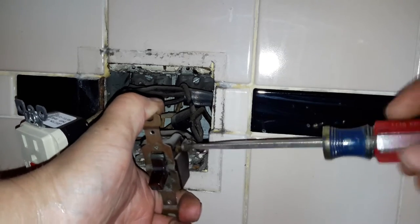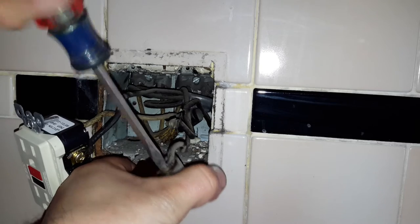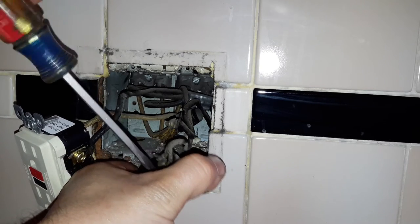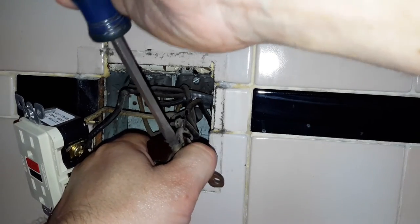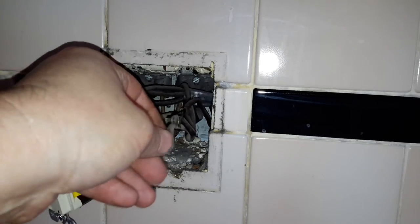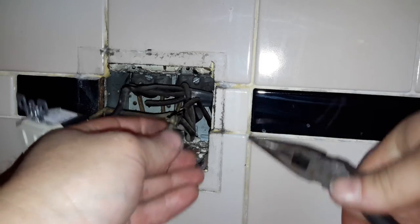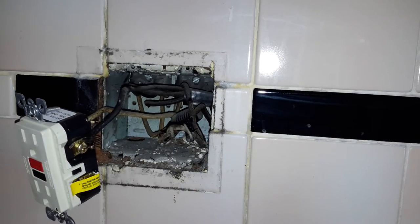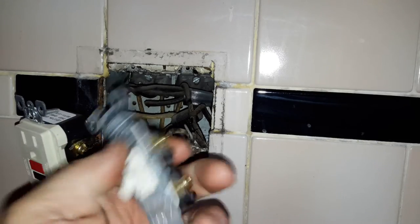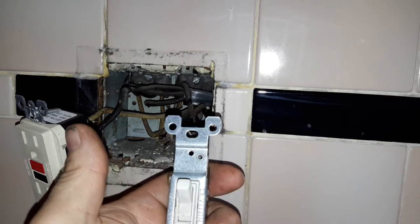On the switch, a switch cuts into your power most of the time. Sometimes you'll see where they use a switch in the white wire to make a light work, but most of the time it's power in, power out. This one is fairly easy — an easy one to change. I'm going to hook the switch up, and once again you want to orient your switch so off is off and on is on, and you don't have a switch that's upside down.